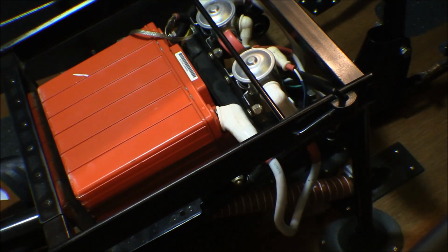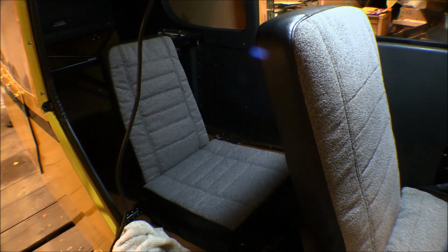There's the new battery cable all hooked up, and I tested it out and it works just fine. That's a 2 gauge cable. That's actually the old battery cable that came out of the old airframe and went from the battery to the solenoids. I had to cut it off to fit. Anyway, that's in there, and that's a lot better. That should carry the current needed for the starter. Got the cable for the battery made up and put in.